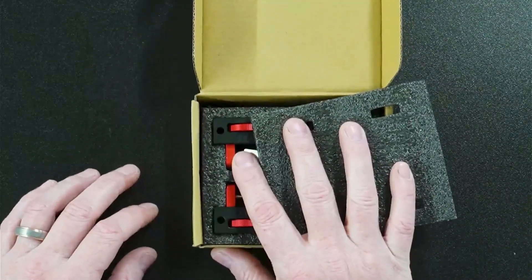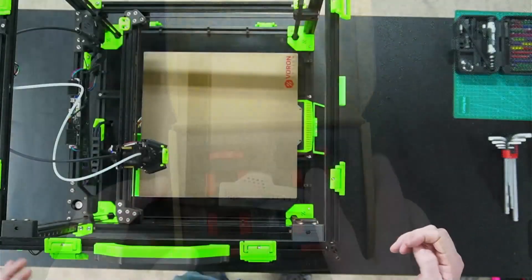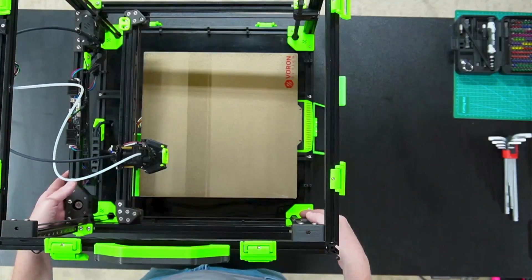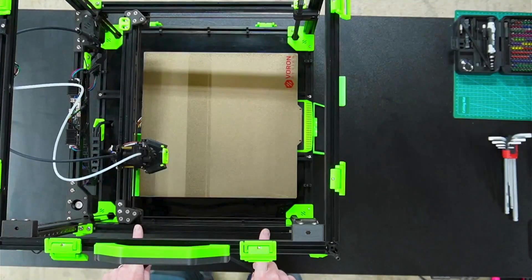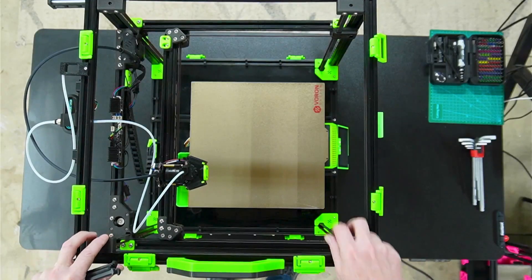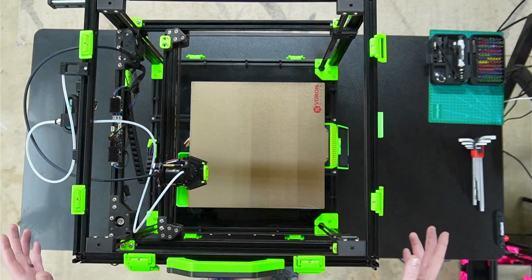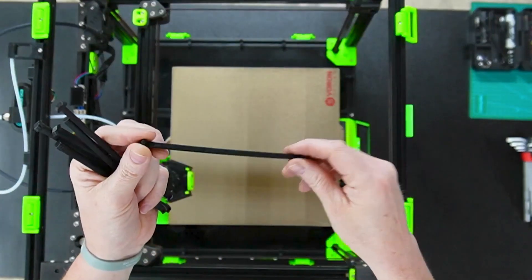I'm going to put the machine up here and show you how to remove the old ones and get these installed. Before we do that, I want to show you something useful: you're going to have to tie your gantry up. You can use zip ties, putting two over here and two over here. We need to take the bolts out — there are two in each one. But if I start loosening things, everything's just going to fall, so I use these locks — I'll put the link in the description.